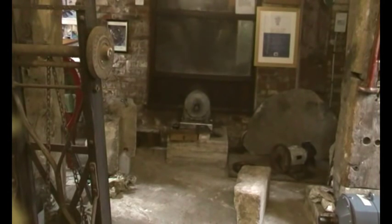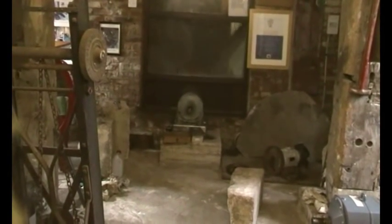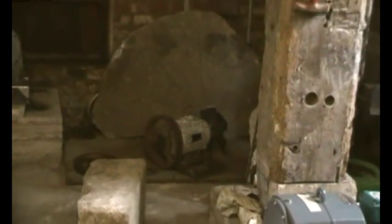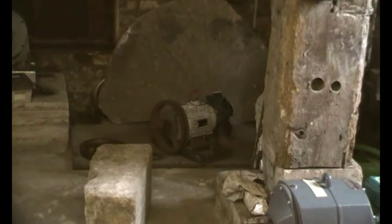What we're going to do is Jim's going to stop the mill, and we're going to put a 10-inch pulley on the end of the gearbox and a 9-inch pulley on the generator down there. We've got 400 revs apparently at the gearbox end at the moment and we want 500 revs on the generator, but we don't want to over-speed the generator, so we'll just do it gradually bit by bit and see what happens.